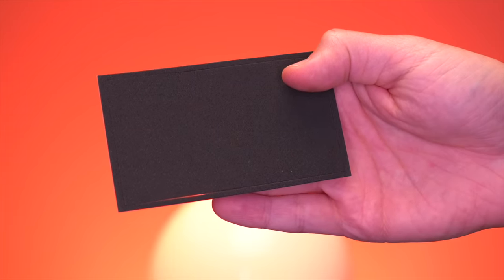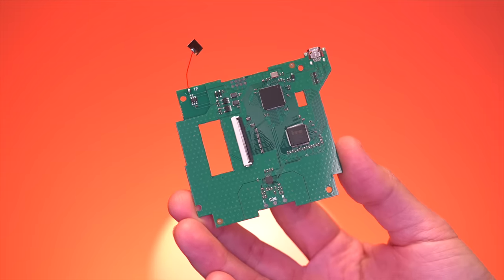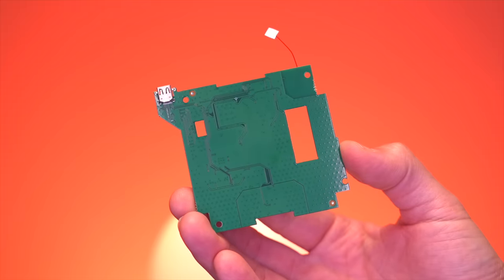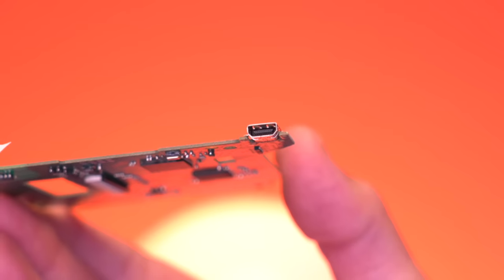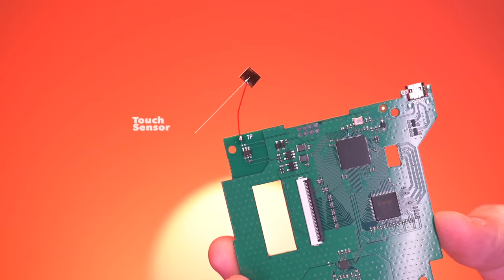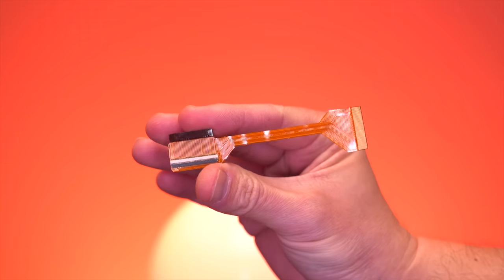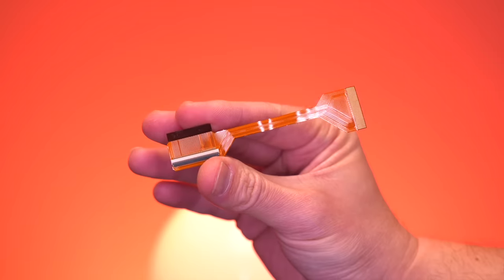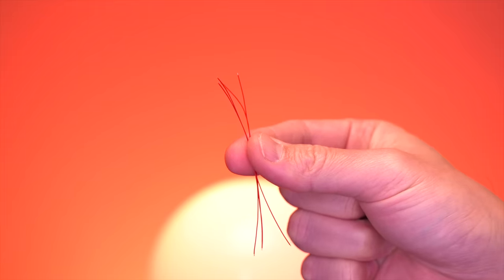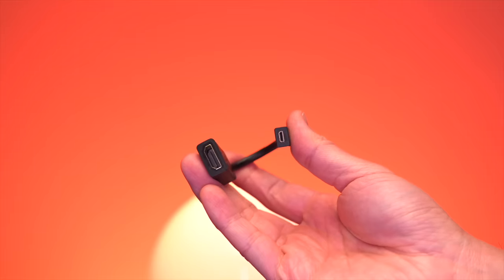Moving over to the HDMI kit, the first item is the main driver board, which intercepts the video coming out from the PSP and converts it to a 720p HDMI video signal. It outputs that video through an HDMI mini port at the top of the PCB. Also connected to the main driver board is a touch sensor used to cycle through the different video output modes. The next item is the ribbon cable that connects the driver board to the LCD connector on the PSP, with a connector to pass the video signal through to the LCD screen. The last things are a few strands of wire for audio connections and an HDMI mini adapter to connect to a TV.